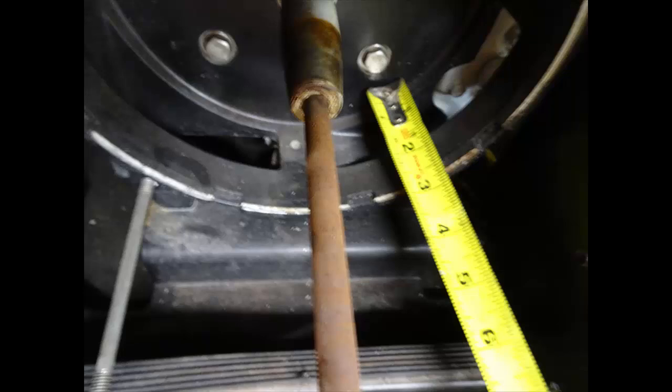We also have the bolt head. So we'll consider 1/8 of an inch for the insert to make the housing lock into the end cap, and then another 1/4 of an inch for the head of the bolt down there at the end of the end cap, which bolts the end cap to the engine. So we end up with about 2.25 inches of clearance on the engine end cap.